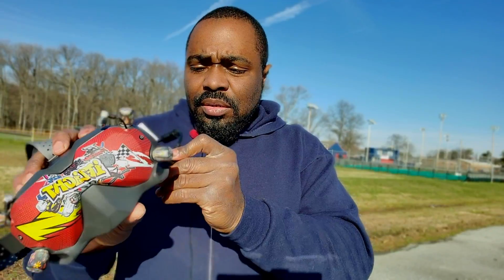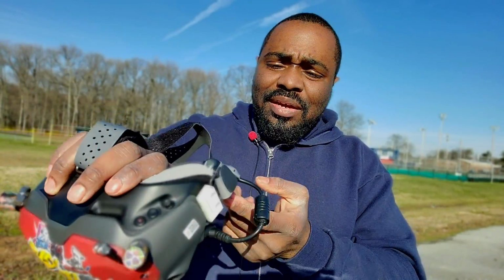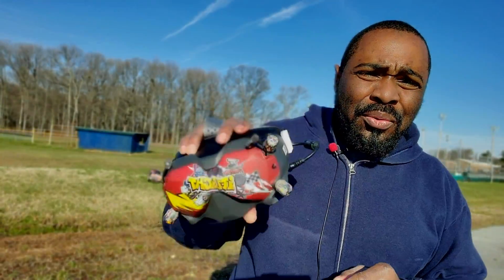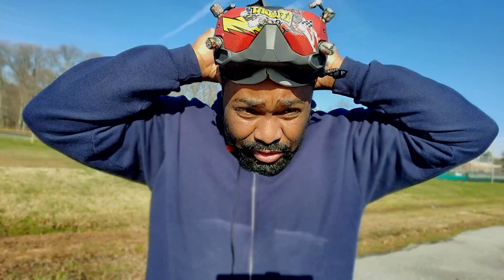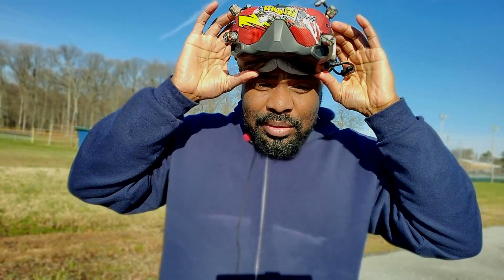Power these up real quick. I forgot my normal battery, so I got this lithium ion battery, and the DJI goggles are voltage vampires. They will suck the life out of a battery. So normally I'm flying with my 3S lithium pack with a long cable that goes into my pocket, and then I pull my head down. In this situation, I got a little portable one here.